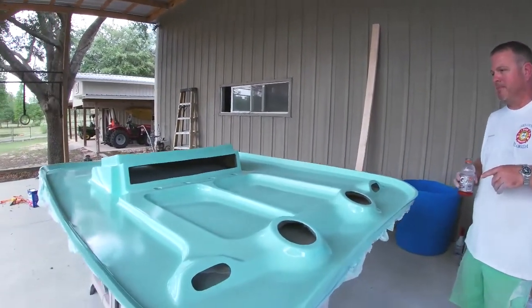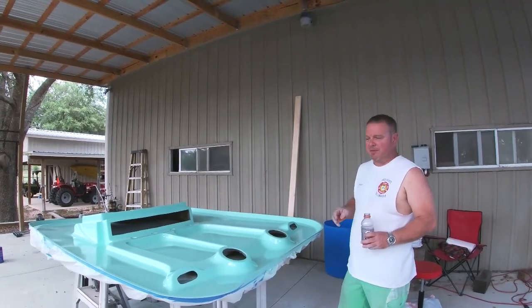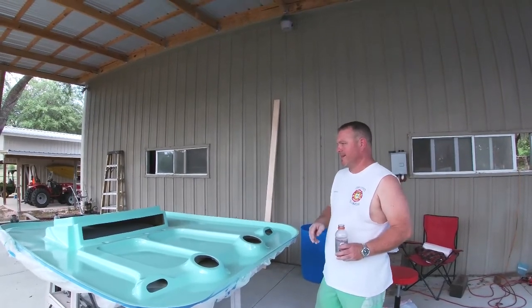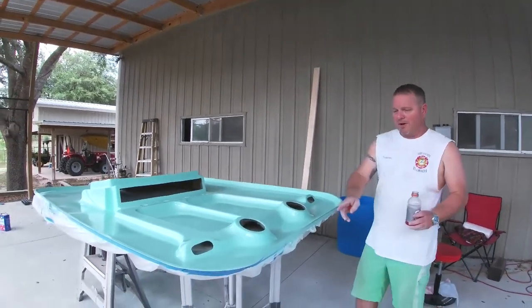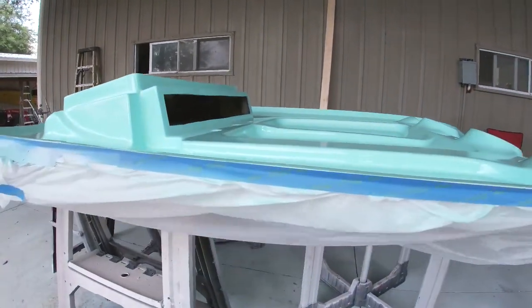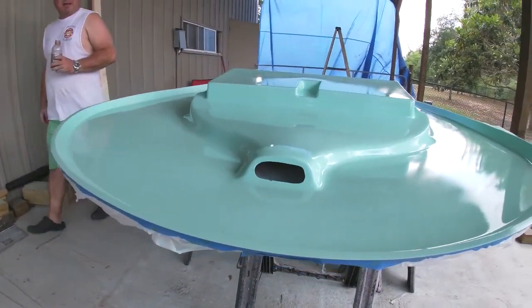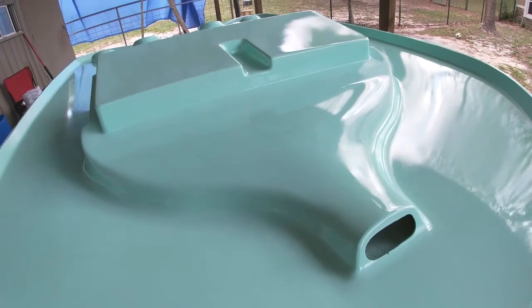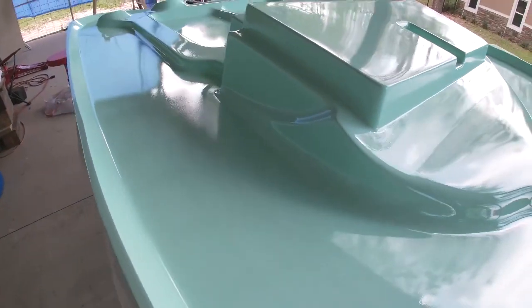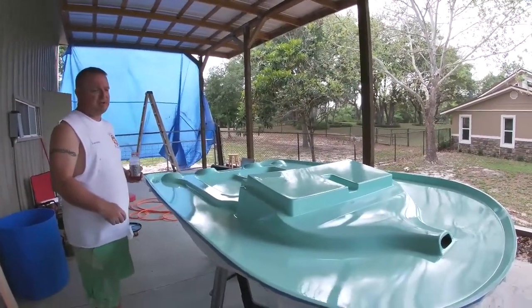This is our last part of painting. This morning we decided to sand this top down, sand the gel coat, rough it up just like we did on the underside of the boat. Sanded everything down, knocked the gloss off of it, and we did that with 220 paper. There are angles and curves you can't really get to, so you've got to do a lot of hand sanding. Cleaned everything off with acetone, got all that dust out, making sure it's perfectly clean. Taped everything off for nice sharp edges. We mixed the PPG primer and sprayed it out with two coats of primer. This is our first coat of paint going down — we've got one more coat. We're going to let this flash for about 45 minutes, then mix up some more paint and hit it one more coat, and then we are finished up with the paint.